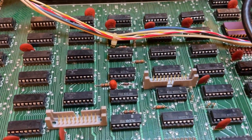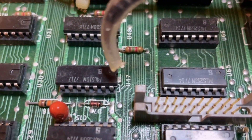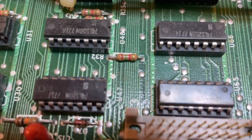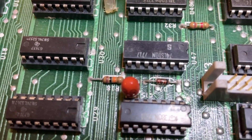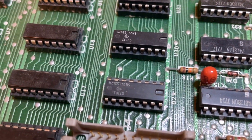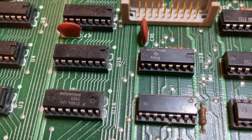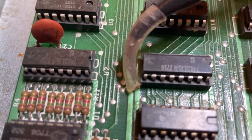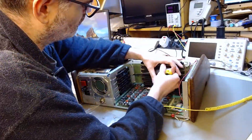Now, once you confront the motherboard, the first thing that jumps out is the pitch. Look at that fine pitch. The design rules are pretty advanced for a 1976 board, and it has clearly been designed with automated CAD tools, and not by hand like other computers of the time, even later ones like the ZX-80 and the ZX-81. These are very fine pitch rules. The vias are pretty large and filled with solder, but we didn't know yet at the time that all the energy goes on the outside of the vias, that you can fill them with anything and it will not reduce the performance.